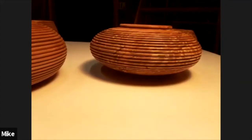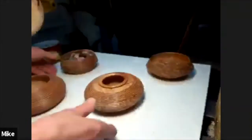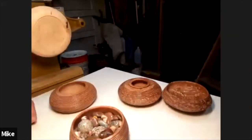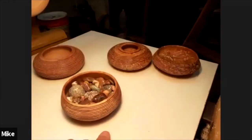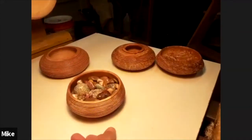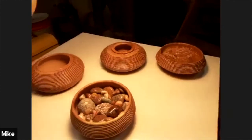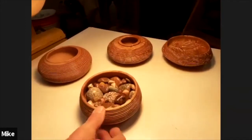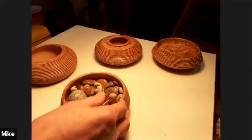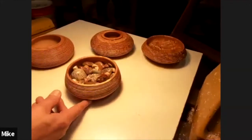Question: what wood types are those? These are all maple — these three are Norway maple, not sure about this one. Hard maple is a very good wood for this. You wouldn't want to try pine. Ring-porous woods don't work quite as well — the tighter the rings the better. White oak would work well; red oak probably all right but not quite as well as white oak. This hard maple that Mike has is perfect. Even it was a little chippy. This ash seemed to cut the best.